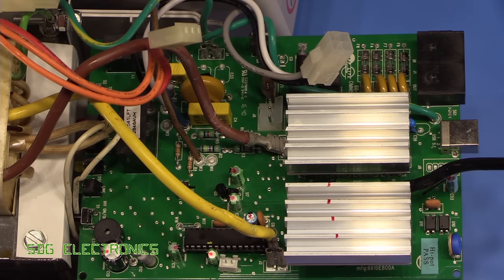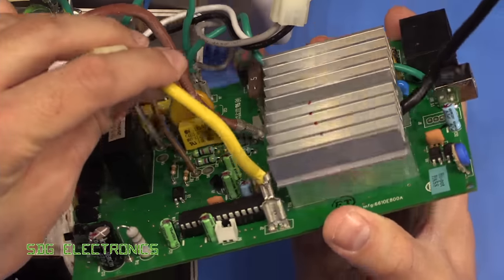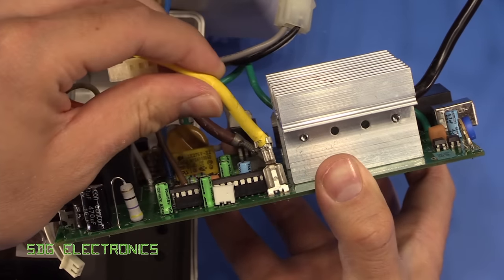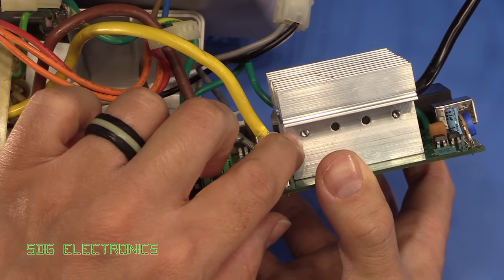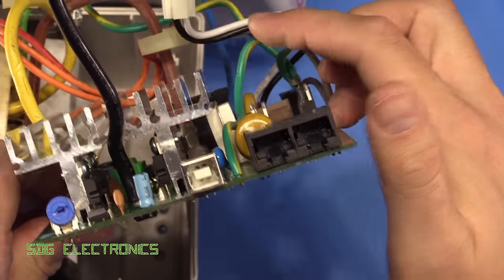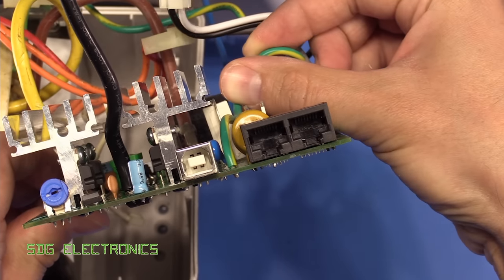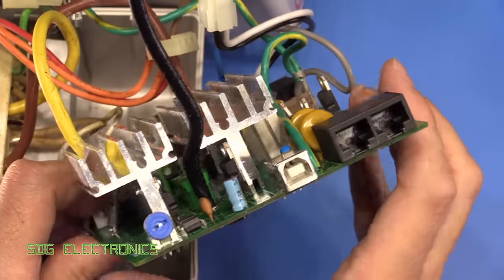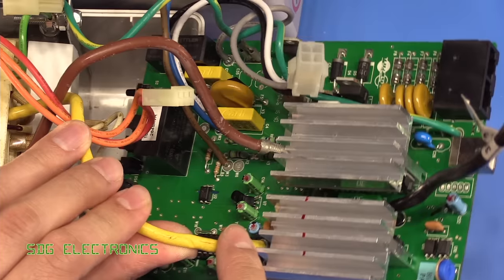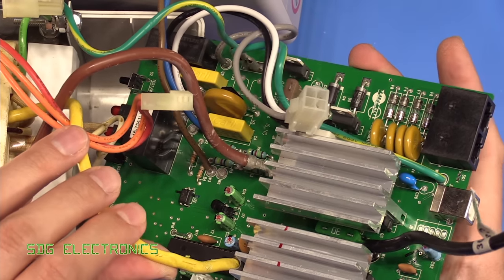Here's the main PCB, and it's a bit of a mess. There are unsheathed Faston connectors — one in particular looks really badly crimped and moves around a lot, and I could conceivably see it touching the heatsink. From the side profile, there's a ceramic wirewound resistor with cables next to it — just a bit of movement and it's already touching the heatsink. There's also a fair amount of damage to the wire insulation which is getting scraped off in a few places.